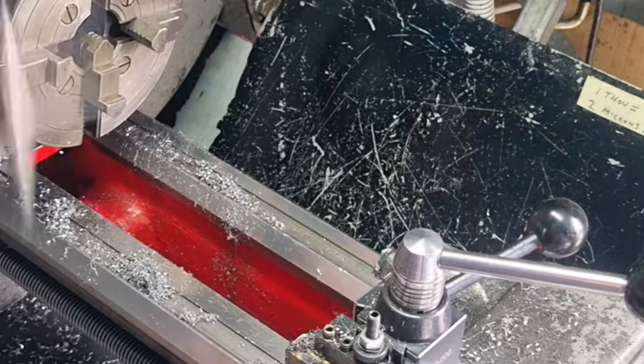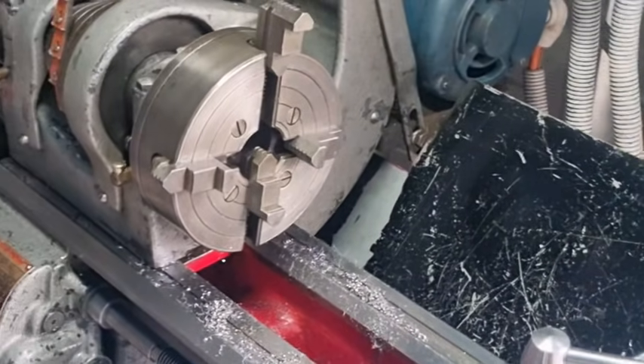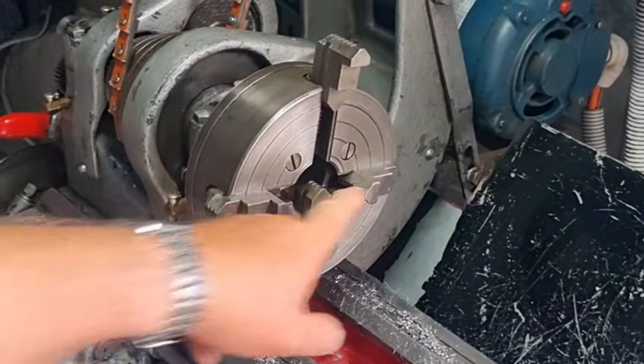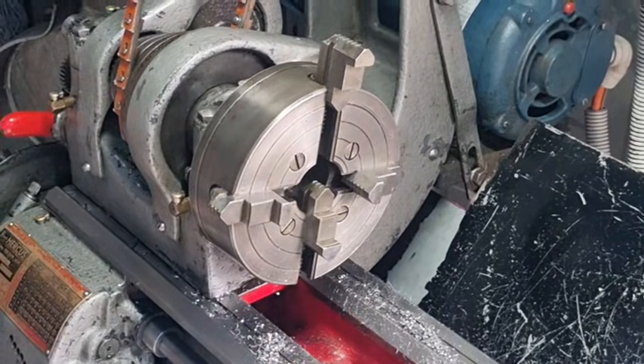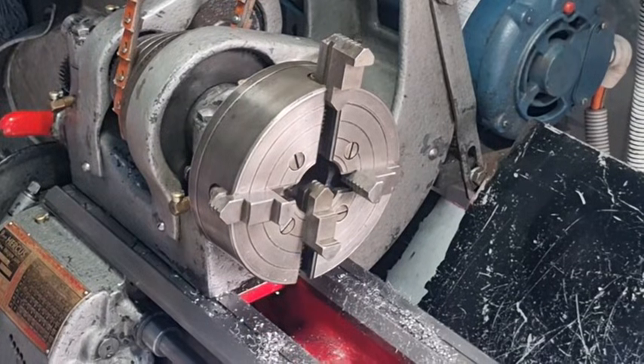Got to get that key. If you look at the configuration of the four-jaw chuck, you can see that the anvil is way off center and these jaws grip it that way. So just turn your four-jaw chuck into a bit of a milling machine and you can mill up some bits and pieces. Thanks for watching. Bye for now.